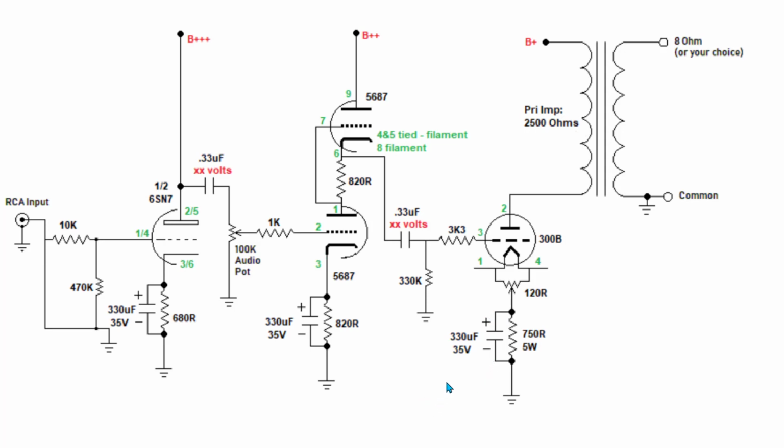And then what I did, remember, capacitors when put in parallel with each other, they add to each other. So I just came in here and put a capacitor in place in parallel with that, giving it the capacitance it needed to eliminate this negative degeneration. And as soon as we did, it lifted the gain up on this tube and our output looked fine. So I just wanted to walk you through from a schematic standpoint.